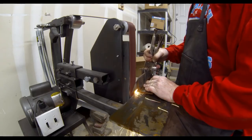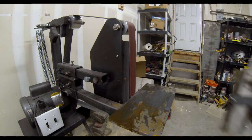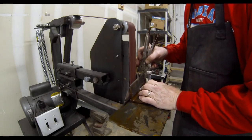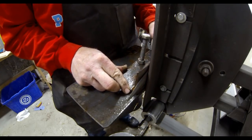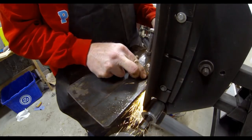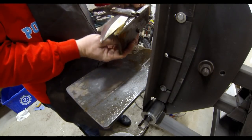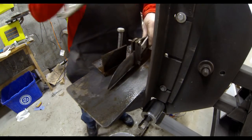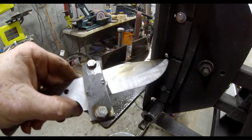I'm looking at the thickness of the blade on the very edge — I marked the center line ahead of time. Now I can watch both sides of that bevel as I'm grinding to bring them both in. The trick is that you can measure down from one edge of the knife to your bevel line so that you can match up and get both of those lines uniform before you unclamp it from the jig. If you were going to polish the bevels, you'd want to change the belt to 400 grit before unclamping and grinding the other bevel. The bevel on both sides is finished.